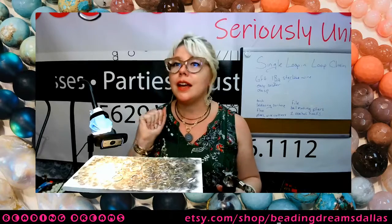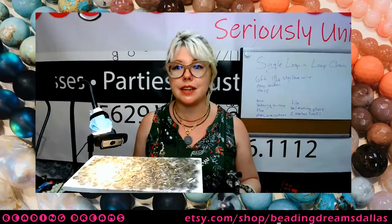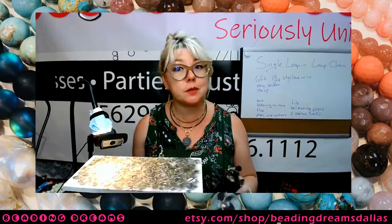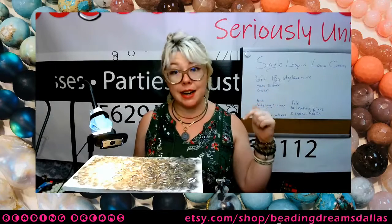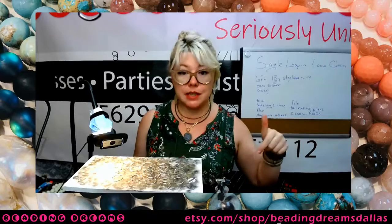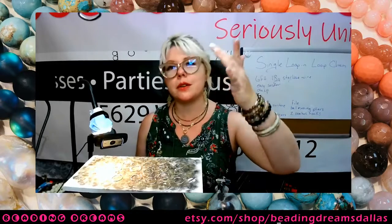And number five, if you're doing this in your own home, you need to make sure that you have a fire extinguisher within arm's reach. If you're doing it in a community workspace, you need to make sure you know where the fire extinguisher is, because usually if you need a fire extinguisher, you need it right now, not 15 minutes later after you ask five people where the fire extinguisher is. So that's your 5-point soldering safety lecture.